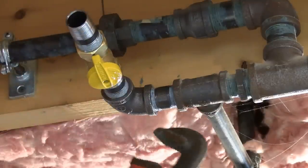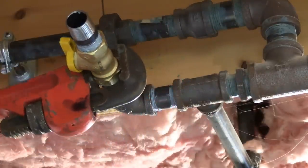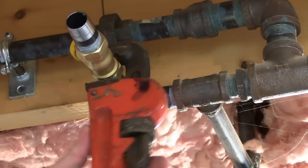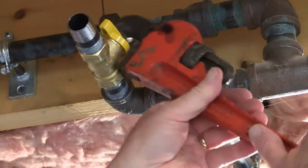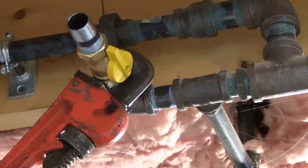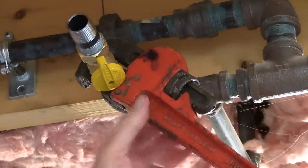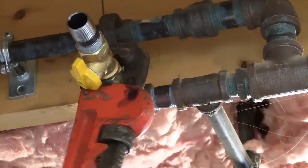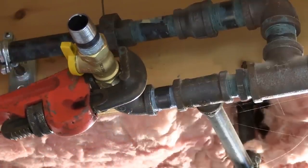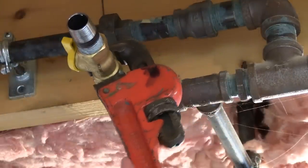Always turn with the heavy brass fitting itself, or steel. You want to be very sure you seat these things because you only get one chance. If you do your pressure testing afterwards and it flunks, you've got to go all the way back and start over again. You only get one chance to do this right without having to undo the whole job.